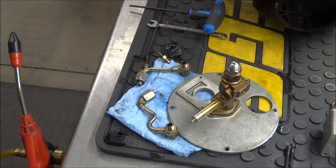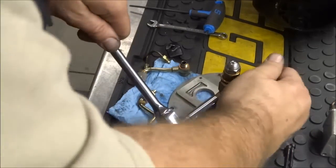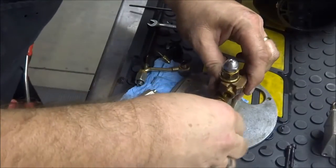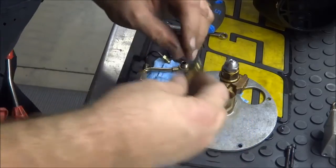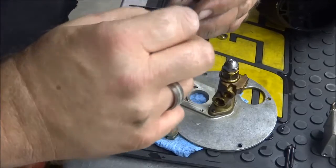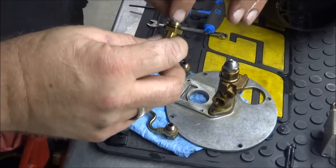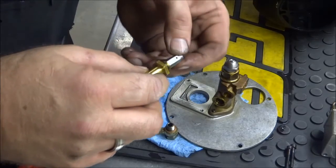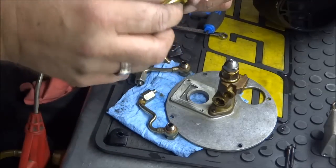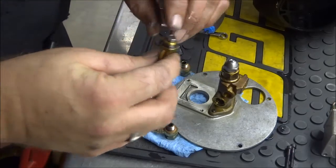I am going to go one step further since I'm right here - I believe that's a 16mm. I'm going to go ahead and pull that out and pop this loose from the stand. So I'm going to go ahead and pull this part out - this is the one I replaced the rebuild kit in. From what Roger told me, and Roger was actually awesome - he included one of these with the parts because he said these can sometimes bend. I felt pretty good about this one when I did it the first time. There was no adverse sticking or anything, so I'm going to go ahead and reuse mine because it's nice and straight and square, and I put the new plunger kit in there.